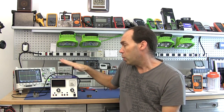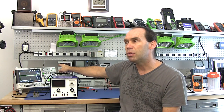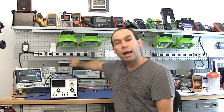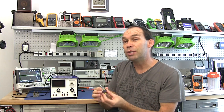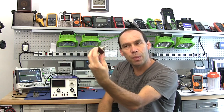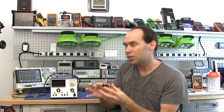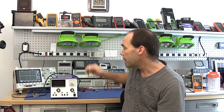We're going to start off by testing certain items for this project. When I did the review of the Isotech power supply, one question people raised was: why don't you measure the rise time of the switch-on? I want to add an input/output switch on my Isotech power supply, so one of the exercises we want to do today is to see whether just adding a normal DC switch can give us that output switch — because there are potentially some challenges there.